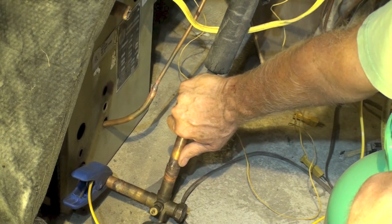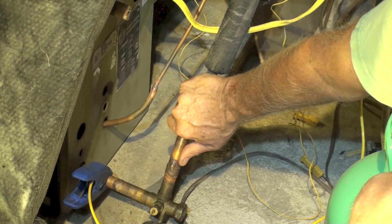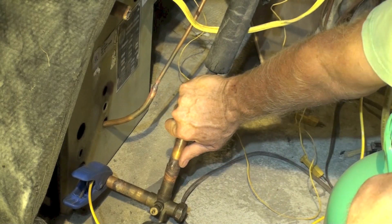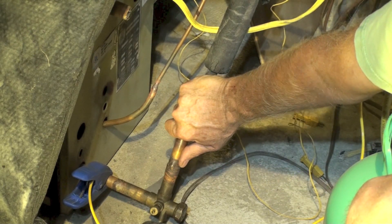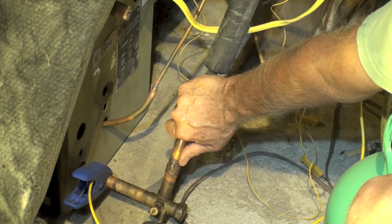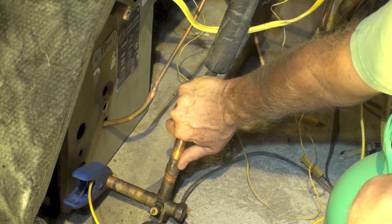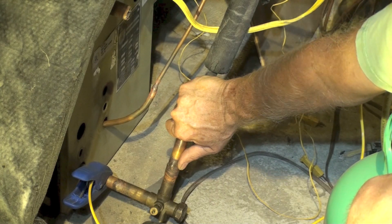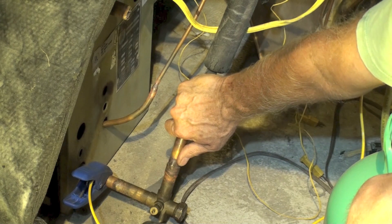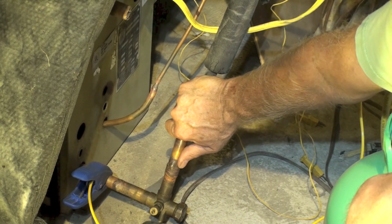Remember, when the gas is coming back and it's being superheated, it's still not all boiled off. The refrigerant inside these lines is not just running through the lines — it's boiling, it's bubbling. There's a little bit of oil in it. It's really turbulent, and so there's going to be a fog. That fog is going to consist of un-evaporated refrigerant and some oil.